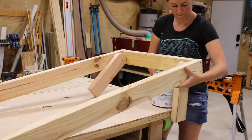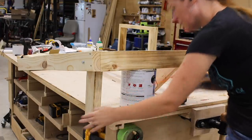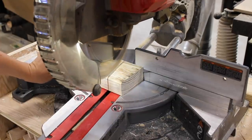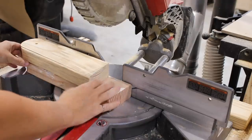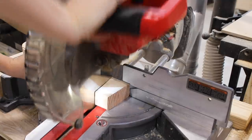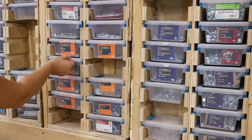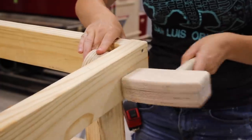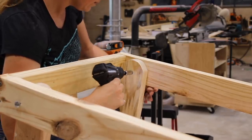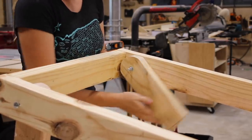Next is to cut the legs to be the exact height needed — there are rules for this game on what dimensions everything should be. I grabbed a gallon paint can to prop the front of the board up, then slid the entire thing to the side of the workbench to scribe a line on the inside of the leg. This gives a visual reference for where to cut the leg and at what angle. After cutting one at the miter saw, I used it as a template to cut the second identically. Then I attached them with a washer and a nylon locking nut — first tap the square shoulder under the bolt head into the wood, then tighten from the inside. Be sure not to over-tighten; the leg should rotate easily.